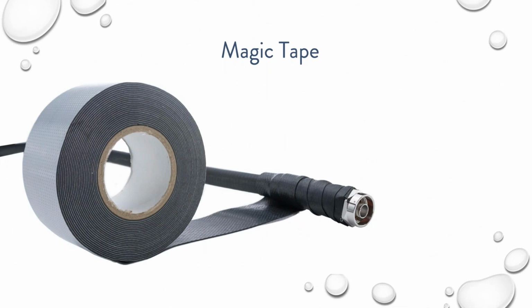So the last weatherproofing product we want to talk about is Magic Tape. And Magic Tape is a fantastic product. It's made from ethylene propylene rubber, which is the same kind of material that EPDM is made from. So not quite as weather resistant or temperature resistant, I should say, as silicone, but still a fantastic solution. It still holds up to some pretty extreme temperatures.